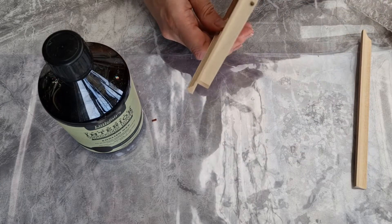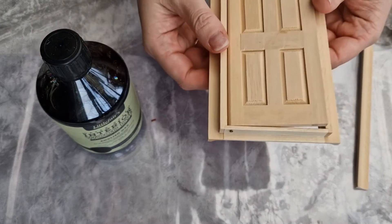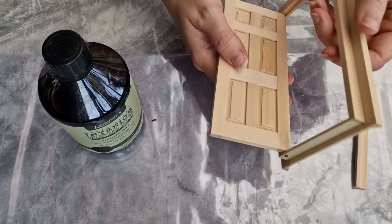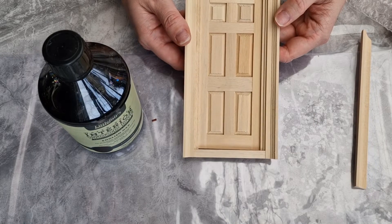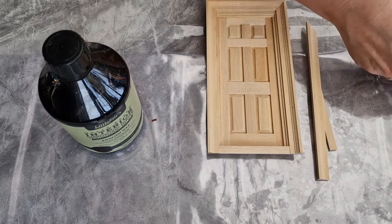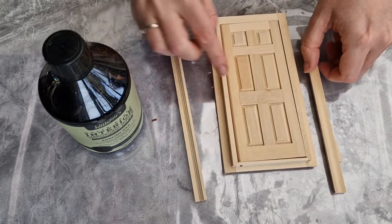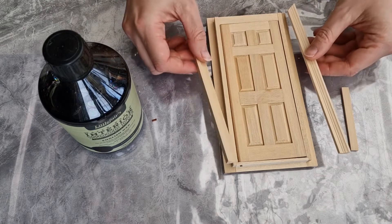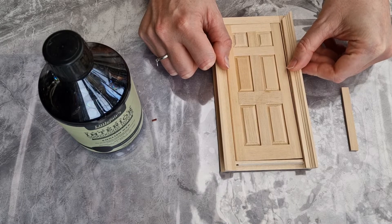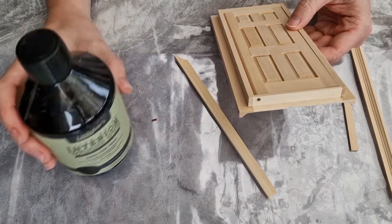I'm going to give it a very light sanding between coats, but because I'm going to be doing two tones on this door, which I haven't done before, I am going to be removing that pin. Take that little pin out and then the door comes out so I can paint both sides completely separately and then reassemble at the end. Obviously these other parts that come with the door, which go on the inside where the door comes through the wall — these need to be painted in the dark colour as well.